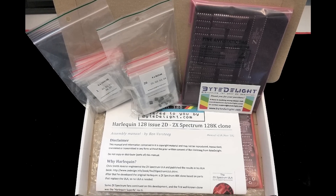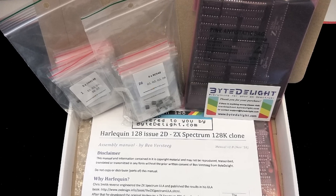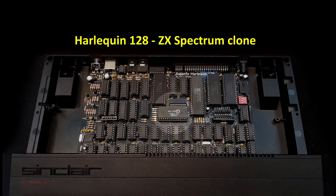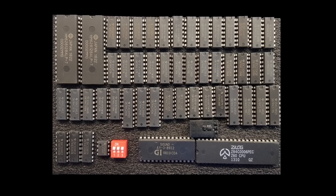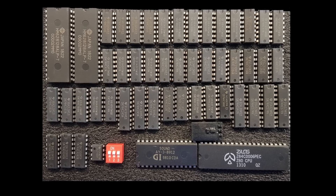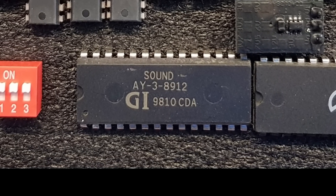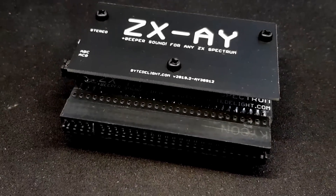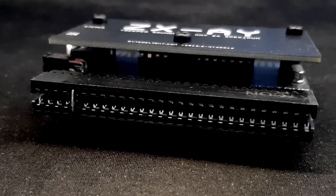Nowadays, apart from the still thousands of uses of original ZX Spectrums, there are also many people who want to build a ZX Spectrum clone DIY kit. The most commonly known option for that are the Harlequin kits. These kits use mostly off-the-shelf parts, so there is no need for using an original ULA chip. However, the Harlequin 128K kits do use an original AY38912 soundchip. And then there is the ZXAY, an external soundcard for the ZX Spectrum using the AY38912 chip as well, though there is a version in development with an AY38910 chip.